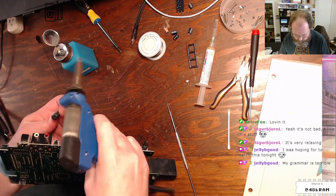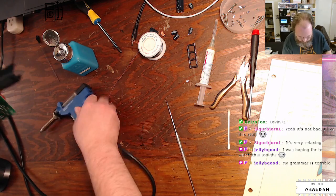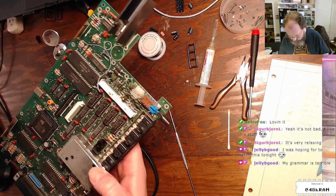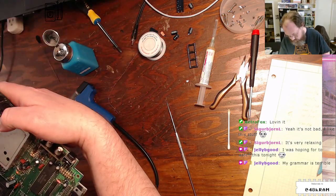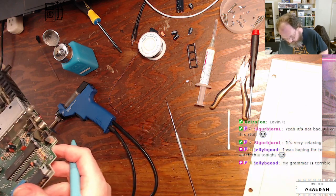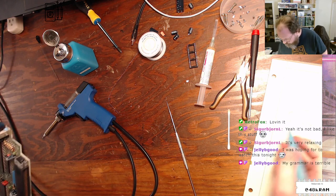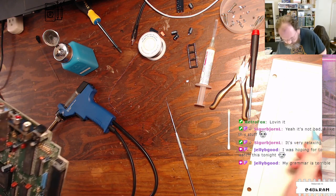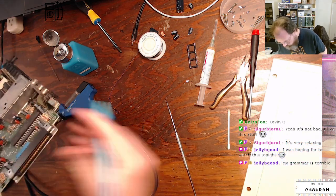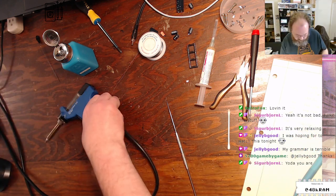I'm very surprised how easy a lot of these capacitors are coming out. Usually, stuff this old, I have a big fight with. Although I suppose this machine's not quite as old as some of the other stuff in my collection. All right, C55. We've got a 10 mic, 25 volt. And then right next to it, C67. Looks probably another 10 mic, 25, yeah. I know the kit was full of 10 mic, 25s, so...